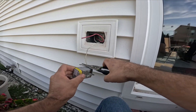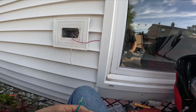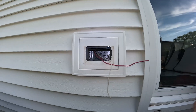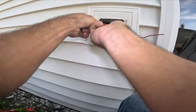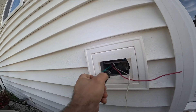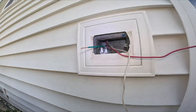We want to make sure nothing gets grounded somewhere so we have nothing blowing up. We're gonna ground this with a pigtail. If you look, there's always a screw hole for ground — it's on the left side. I love these pre-made ones. On older boxes I try to screw it in, and they make clips for toe-clip grounds — so if there's no point to attach the ground you can just clip it on. Okay, we're all grounded now.